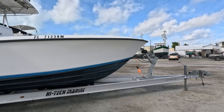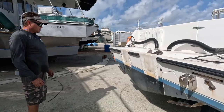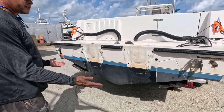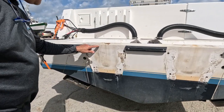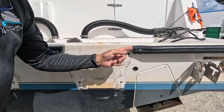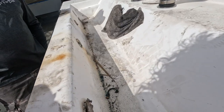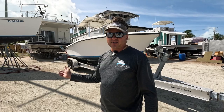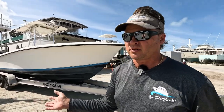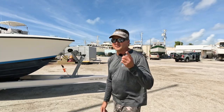You can see it's a cute little boat and it catches some great fish — just need to get it fixed up a little bit. I have to do an insurance estimate on it. The transom, they hit the motors, the lower units, and one is destroyed and the other one is damaged. You can see we have cracks all through here. All this needs to be ground out and chased out, filled and faired. We'll probably end up cutting a good portion of this transom out — it's cracked all in here too. So I'm curious what you think: should we replace the whole transom, or do you think it's just a partial repair?